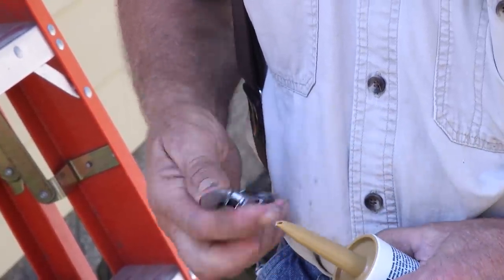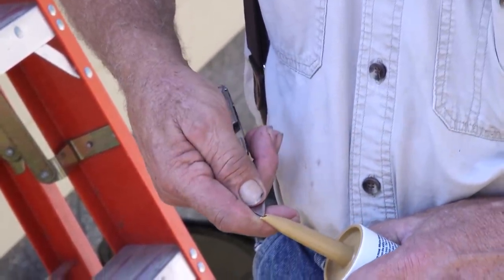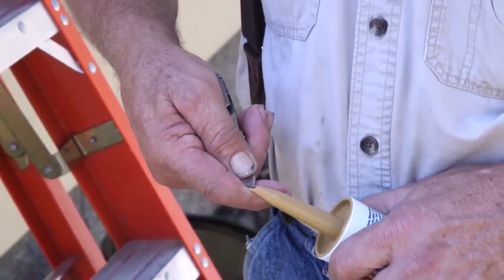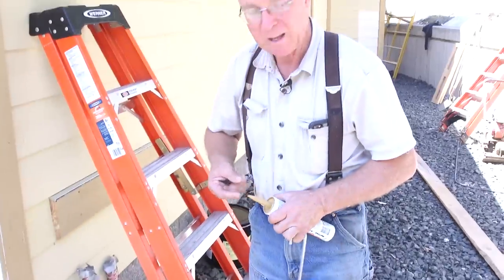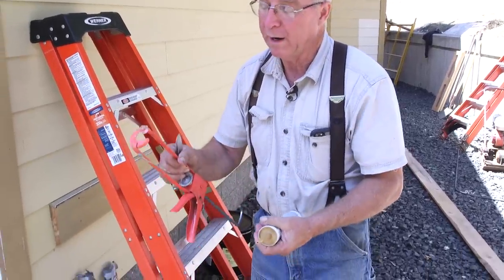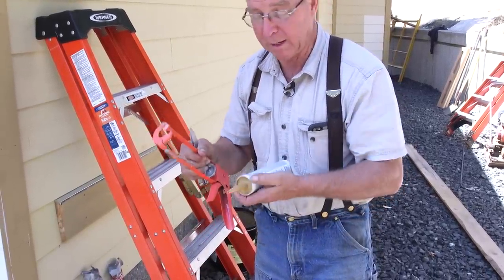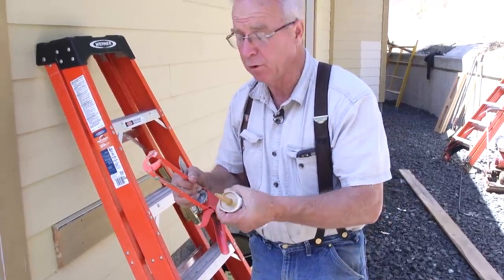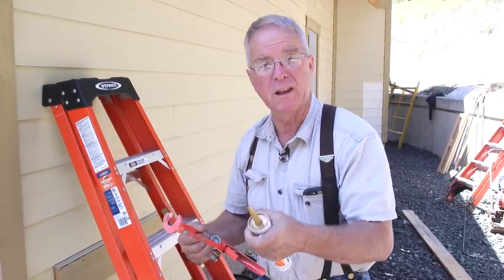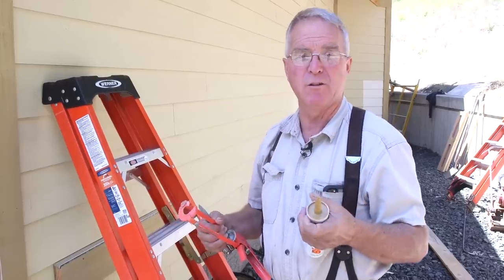I would say I shoot for that's about a 16th of an inch, a little more than a 16th, maybe 3/32. It's certainly not an eighth. It's small. It will just barely receive the wire that's on lots of caulking guns for breaking the foil at the end of the tube, which Big Stretch doesn't have, but it's just a little opening that if I need to enlarge, is easy to enlarge.